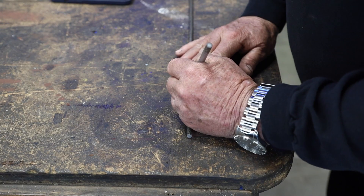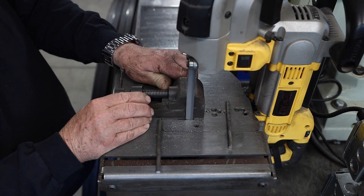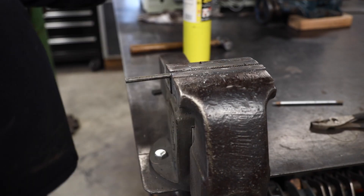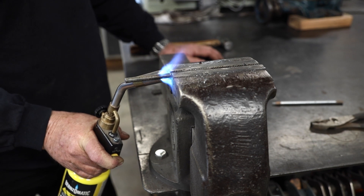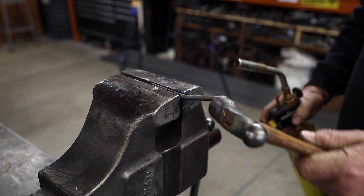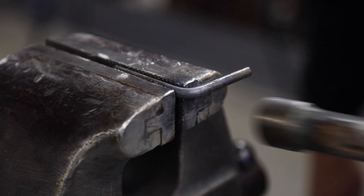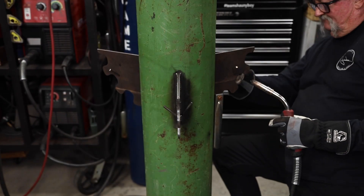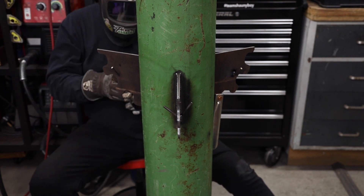This is the quarter-inch round bar stock — I'm cutting three pieces to about four inches long. The plan is to bend them at a 90-degree angle, feed them through that hole, and give it a little 45-degree angle hook, just enough to hang a coat or handbag on it. I got my propane or MAP gas torch and put a little heat on it to get a tighter bend than I'd get bending it cold in the vice. After sticking them through the holes and getting them all welded into position, I went around and bent them all down evenly.